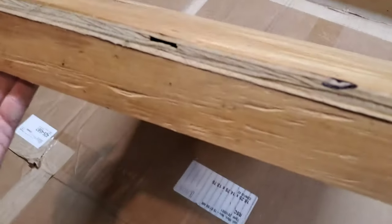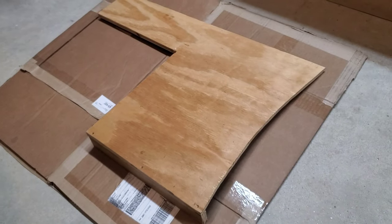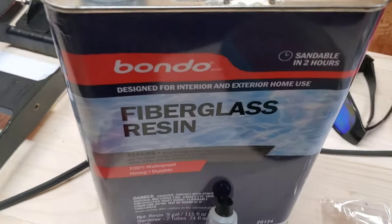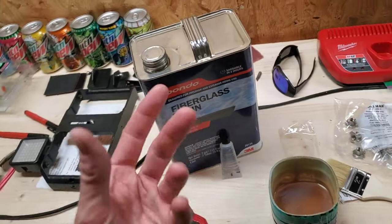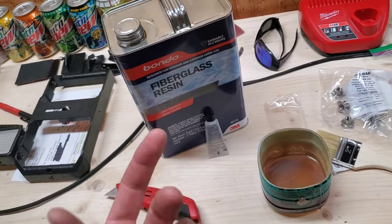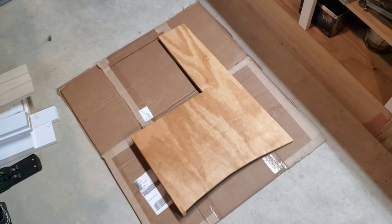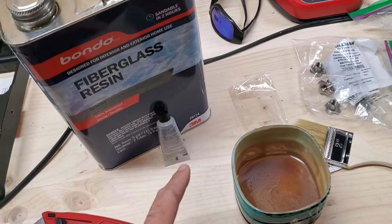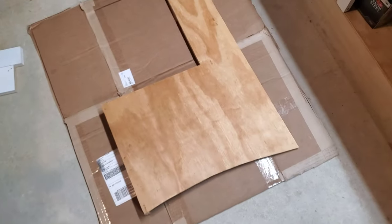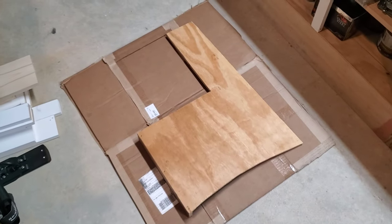Got this attached on the face. Now what I'm going to do is coat it in fiberglass resin — coat the part in fiberglass resin, exterior home use and 100% waterproof. If you know me, I've used this for years on my channel and gotten good results. Even though it's polyester resin, it still adds a really good layer of protection to the wood as opposed to leaving it untreated. I'm going to mix the resin and the hardener, spread it out in a nice thick layer on the part and get the perimeter and all the edges, then let it sit in the garage and cure overnight.